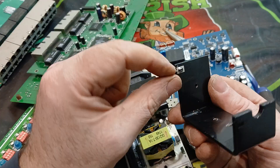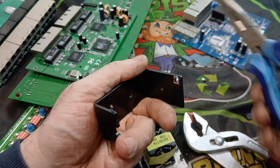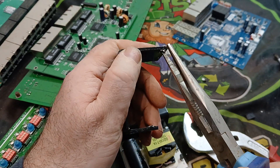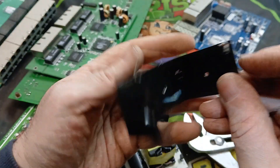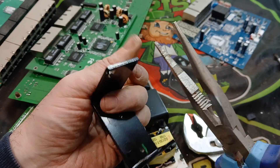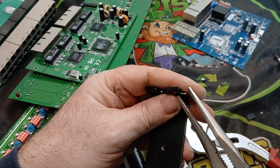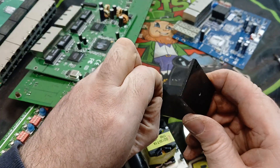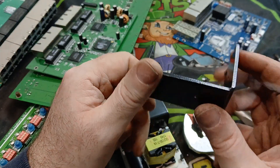These bits here are going to be magnetic so they need to come off as well. Usually come off fairly easy — and when I say usually, I mean a little bit of effort. I'll have to get the chisel and knock them off. There we go — we have it off. Take them off and then you've got your clean aluminium and you'll get your better price at the scrapyard. These little bits come off as well — you don't want any tape, you don't want any paint, anything that can downgrade you. Just scrape that off and there's your clean aluminium.